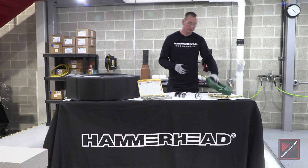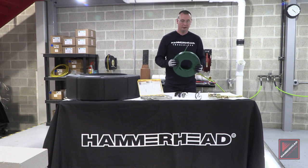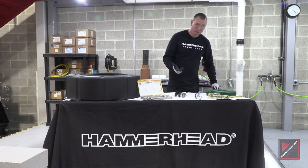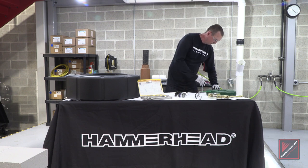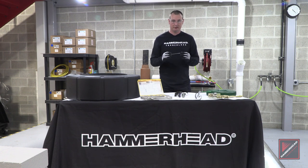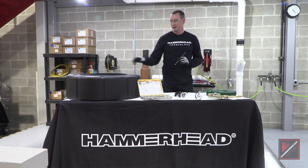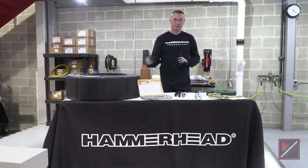The last item we have here is what we call the router. It has a special engineered tip on the end. It's shorter than your normal routers and navigates bends a little easier, being more efficient at getting through any abrupt stops within the service itself. To connect the router to the cable, the kit provides stainless steel zip ties. The zip tie goes through the eyelet on the router and connects to the eyelet on the end of the quarter inch cable, so the router can be pulled and the cable can be pushed to get the cable through the pipe completely.